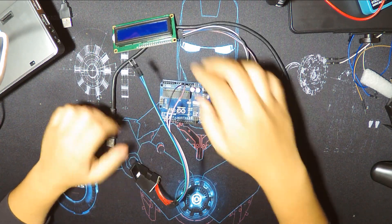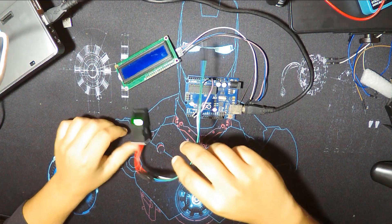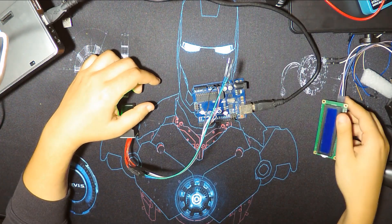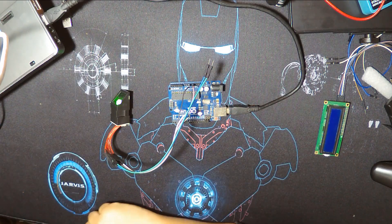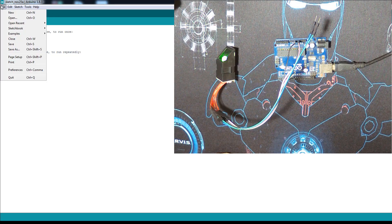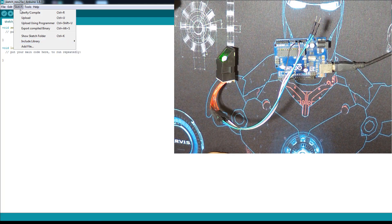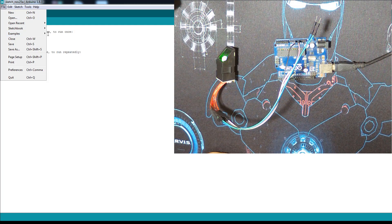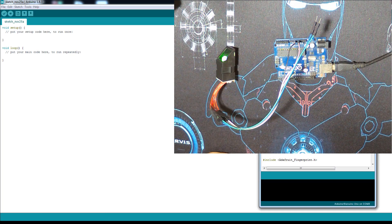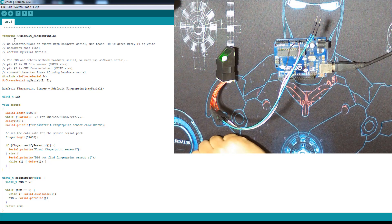The other pins are not connected. Already flashing an LED here to show it is working. I will not plug my LCD screen yet — we're going to just use the serial monitor. I'll leave the library in the link. You install it by going to Sketch > Include Library > Add .ZIP Library. Now we're going to check some examples from this library. The first example you want to use is the Enroll.